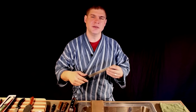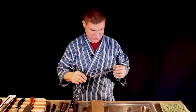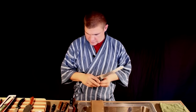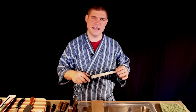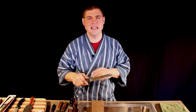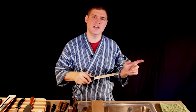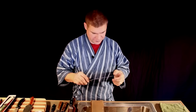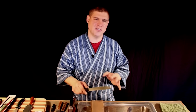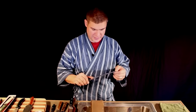Now, especially with the less expensive knives that you might find at the supermarket, that seem to be plentiful in a lot of people's kitchens, they have certain serration patterns. You see two different patterns here of serrations. Serrations in general are put in knives of lesser quality steel to enhance their cutting performance. By putting serrations in a blade, it effectively elongates the cutting surface. If this was a 7-inch blade here, you effectively get 8 inches' worth of cutting edge by making the cutting edge wavy. The other thing too is that the tips of a serration will contact hard surfaces first, and they'll get dull and kind of protect the inner scalloped cutting edges of serrations. Well, in theory, it all sounds kind of cool, but they don't cut very well.